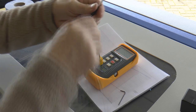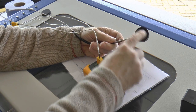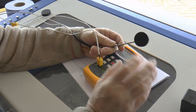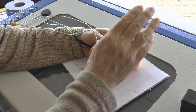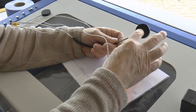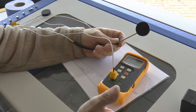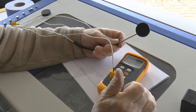So now we have here the elements of a comparator. We've got a block of aluminium which has been anodized and will absorb some of the heat that's fired at it, some of the infrared radiation that's fired at it. How much we don't know, but it doesn't matter. We've got a means of measuring the amount of heat right in the centre of that block with our K-type thermocouple. All we need now is a known power source so that we can start to calibrate this.